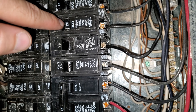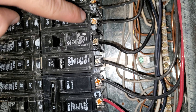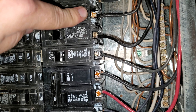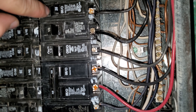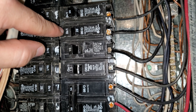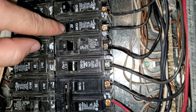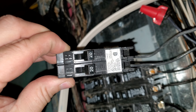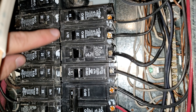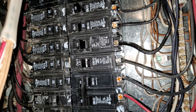With this one in the off position, I've removed this screw. When this is in the on position, that screw is live with 120 volts. I'm going to temporarily take a wire and attach it here to provide power while we wait for one of these double breakers. We're in a remote location in North Dakota, so we're ordering a couple of them — a little double throw like this — and that will replace this one, and we'll do another one for these so we can actually have more breakers.